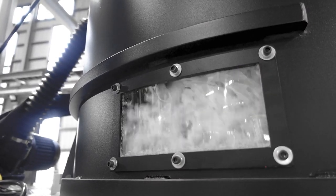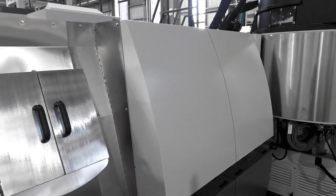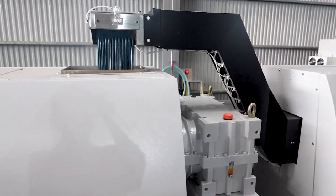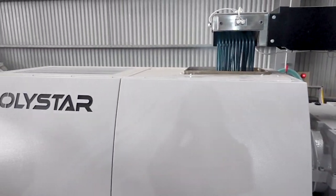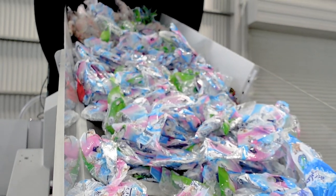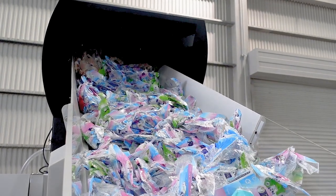This simple but powerful plastic recycling machine combines cutting, extrusion, and pelletizing. Reproflex Plus has an additional extruder as well as three degassing zones and two filtration units. It is designed specifically for processing heavily printed BOPP film.